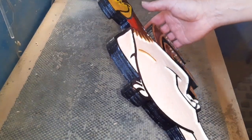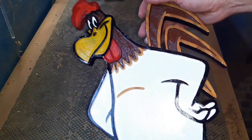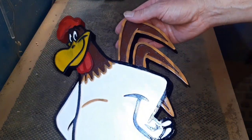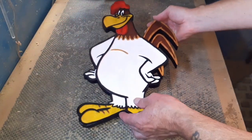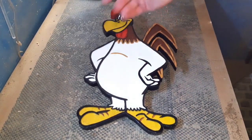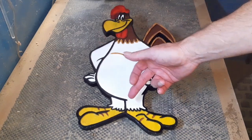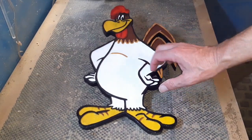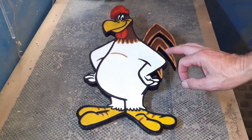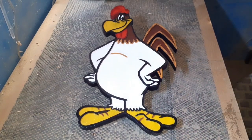I've actually painted the sides of this one black, and we did the background, the back piece as well, should I say. And that's it. Just a nice little fun project. So remember, it measures in at 17 inches by roughly 11 inches across. We used CNC bits to do all our lines, and then we came in with the end milling bits to clear out with. We did have some straight flush bits put to one side, but we didn't need them. It came out really easy, especially when you use a nice new sharp bit.